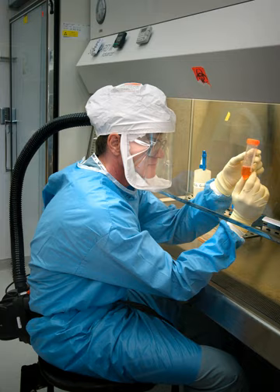To mitigate this risk, cabinets of these types generally monitor the exhaust flow, shutting off the supply blower and sounding an alarm if the exhaust flow is insufficient. The type C1 BSC was born out of necessity to control infectious material, chemical hazards, reduce operating costs, and add flexibility in modern laboratories. The type C1 moves air by mixing inflow air with the air in the columns of downflow air marked for recirculation. Air above a clearly delineated section of the work surface is drawn by a second internal fan where it is exhausted through a HEPA filter. The C1 differs from a type A in that it can use single-pass airflow, and when installed in a ducted operating mode, can protect from hazardous chemistry like the type Bs.